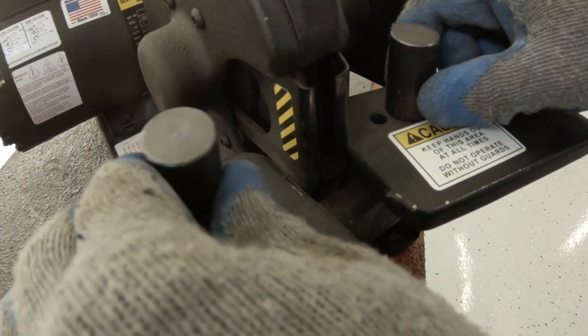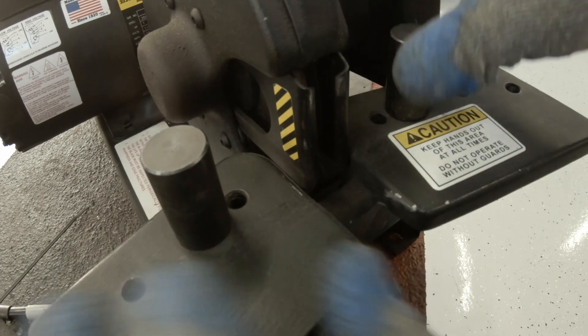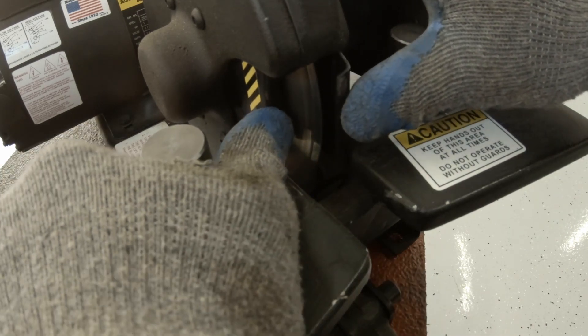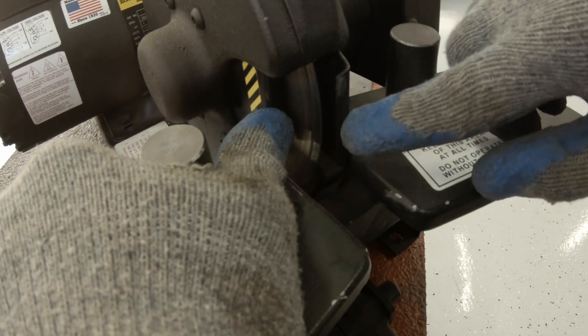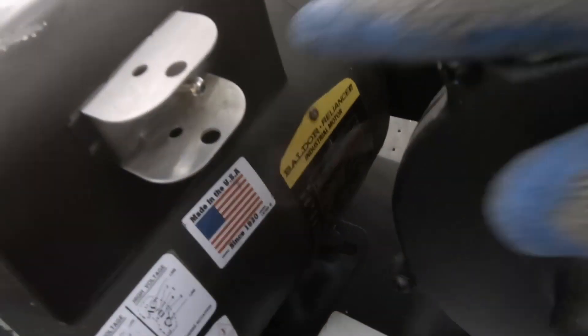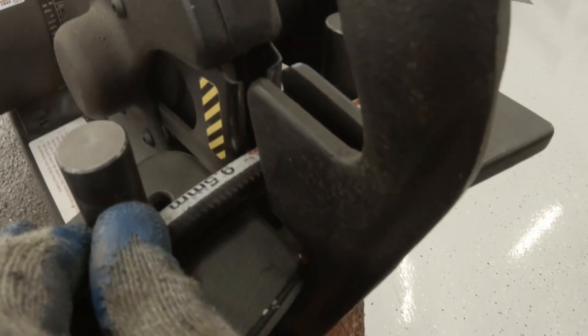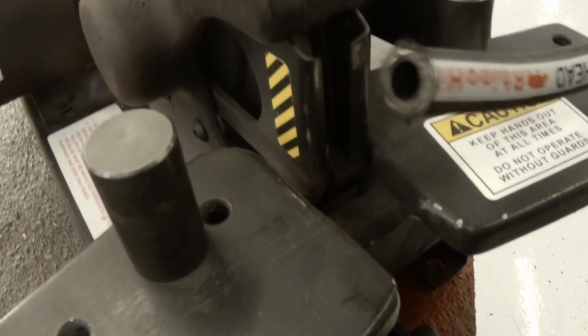Here I am measuring out a hose. We have this cutter here — I like this cutter a lot. If you look closely, it has a metal blade that cuts the hose. It's a really nice, clean cut, which is good on hydraulic hoses especially. All right, let's turn this on — we're going to get our hose pressed in there. It looks really good, nice and clean, which is really important.